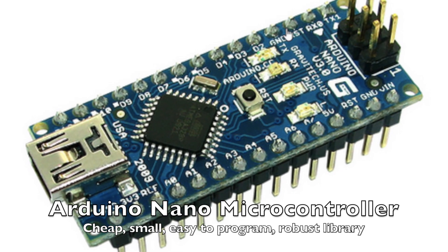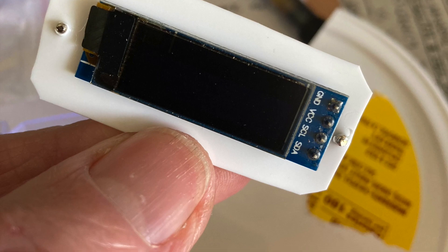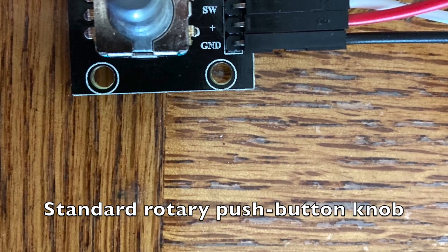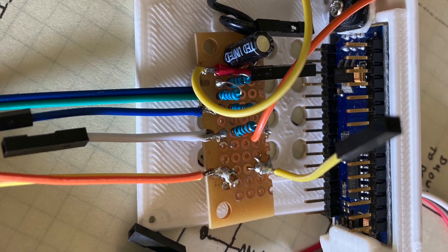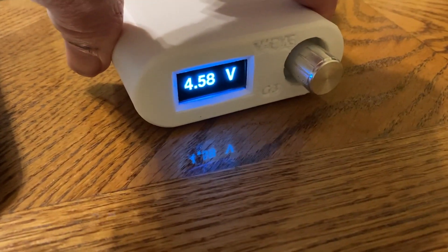The main components on this latest version include an Arduino Nano — it's very small in size and has low power requirements that will fit into this very small case — a low cost OLED screen, and a rotary digital encoder with the ability to push the button on top to get a select signal. All that goes together into the case. Everything is hand-wired, so it's pretty much a spaghetti mess inside right now with the way it's put together in the prototype.